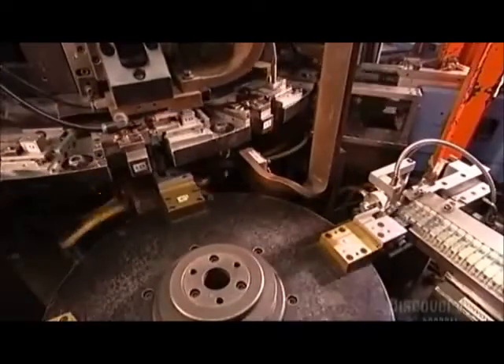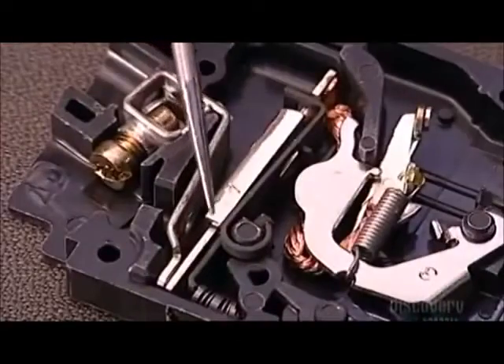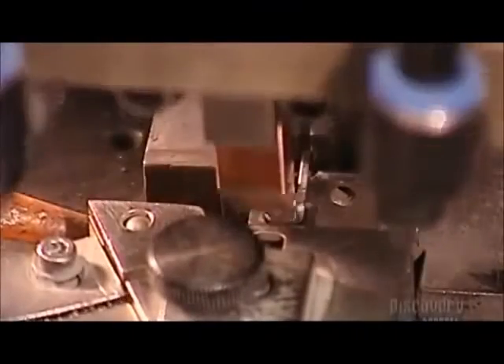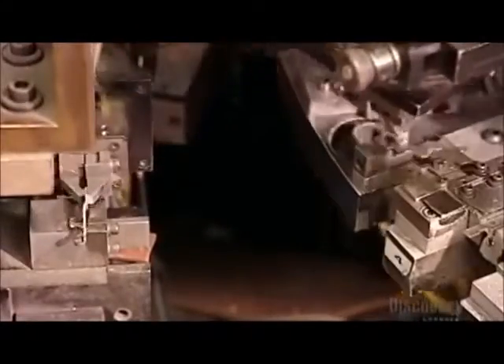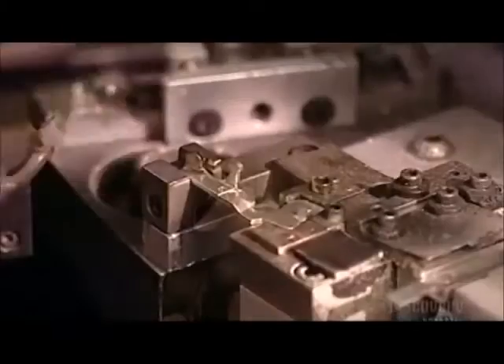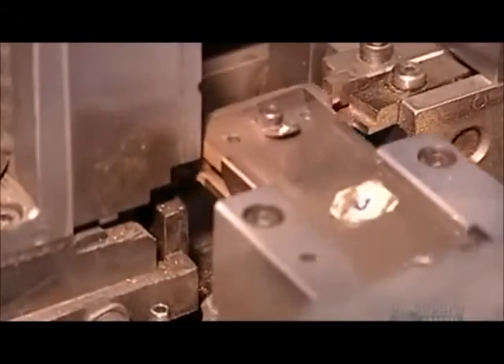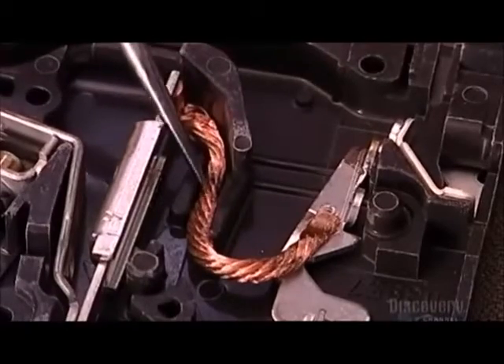A circular machine called Robot A assembles the breaker parts along its 16 workstations. Another breaker component is the bi-metal assembly — an alloy of two metals and a magnet — which trips the breaker when there's an overload or short circuit. Robot A welds a strip of silver, which is conductive, to what's called the contact arm, then positions the arm for welding with 5 cm long segments of braided copper wire — copper because it's conductive as well as pliable. The robot fuses the copper wire to the contact arm and the bi-metal assembly. The wire will flex with the arm to touch what's called the line terminal, and this contact permits the electrical current to flow.